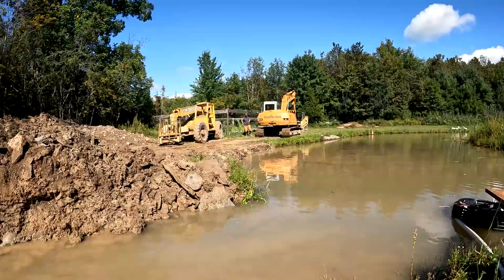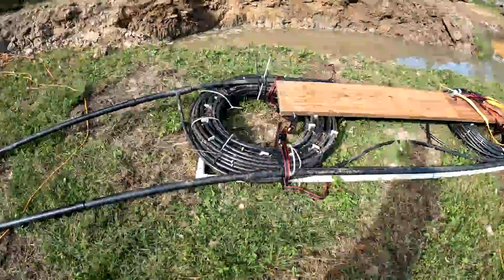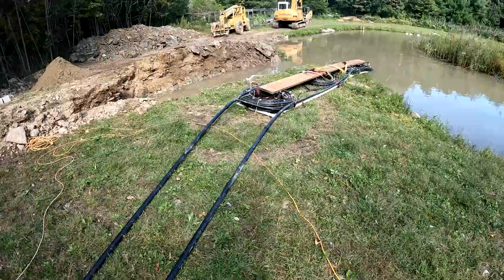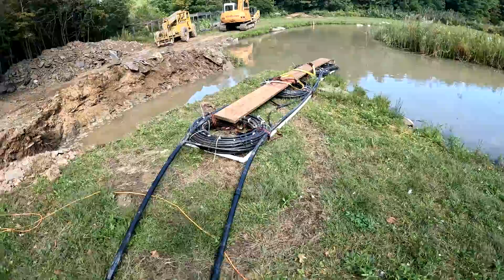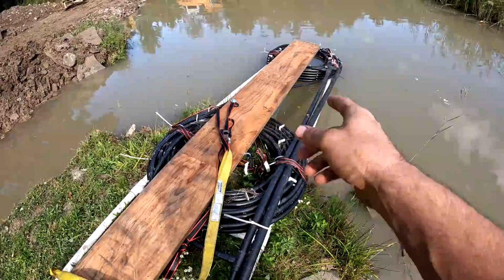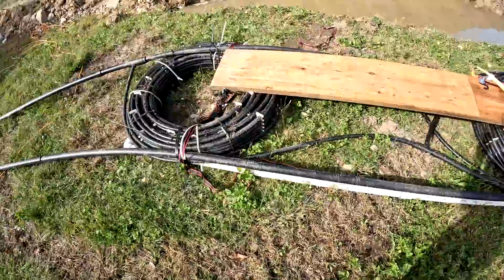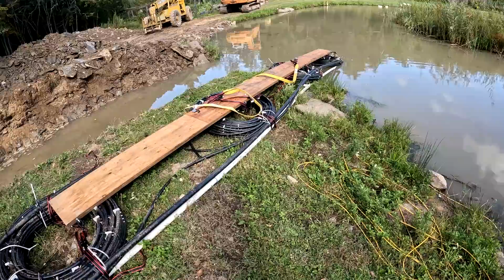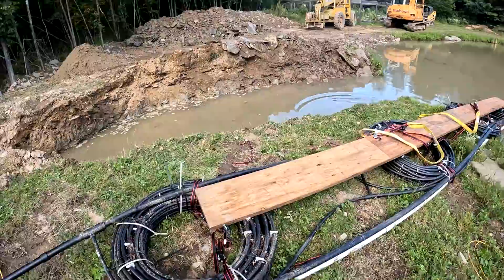All right, so at this point, what we're doing is testing out the loop. We're gonna put 100 pounds of pressure in it, just air, 100 PSI, and we're gonna fill it up from the other end and just test for any leaks. And while Eric is doing that, me and Pat are gonna come over here and attach the blocks to this. So we need to attach one block for each side of each loop, so 8 blocks. And it might not be quite enough, so we might have to use another half block in conjunction with that. And then once we got the blocks hooked up, we can drop this loop in here as long as we don't have any leaks. So that'll be done for that part of it. And then we can start backfilling from here, backfilling into the building.